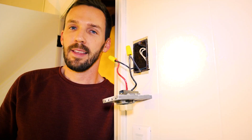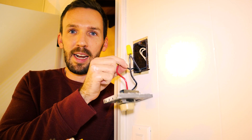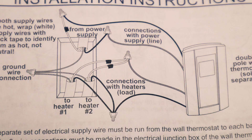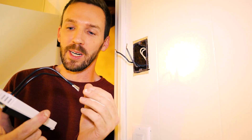This is the easiest thing ever. This thermostat has two wires and I have two separate sets of wires coming into my box — a black here and a black there — and I'm just swapping this out one for one. You tie your neutrals up together and tie your grounds up together. Make sure your power's off. The easiest part: it doesn't matter which wire goes to which — they're non-polarized. It just says it doesn't matter.